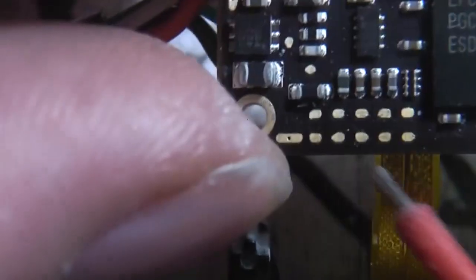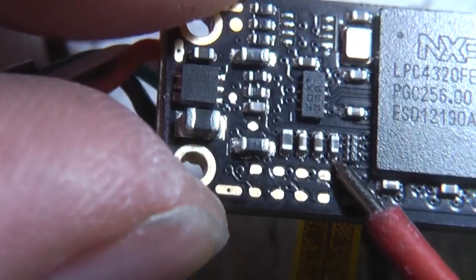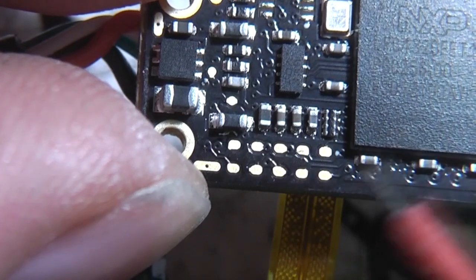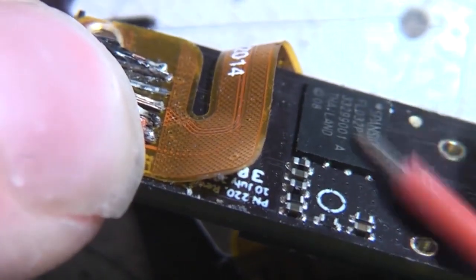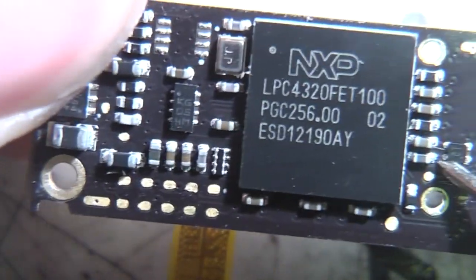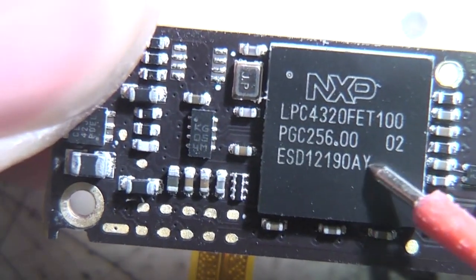There's these 4 test points, there's a few other test points, and obviously there's this group here, and this is going to be, I'm not totally familiar with this chip, I'll have to look it up, whether it's JTAG or direct connections to this flash. I don't know if this has got a mechanism for programming the external flash via the debug port or not. It may well have. I'll have a look through that a bit later.